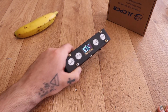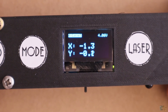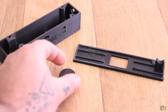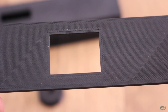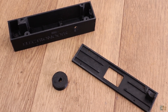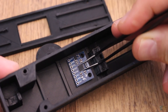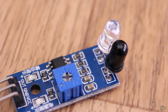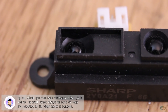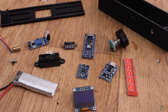Welcome back. We've already seen all the modes of this multifunctional meter — it could measure distance, angles and RPMs. First of all, it has a 3D printed case that I've designed, printed using PLA material with a 0.4 mm nozzle, 0.2 mm layer height and 2 perimeters. The case has spaces for all the modules: the MPU6050 gyro and accelerometer, the infrared sensor for counting rotations, the VL53L0X laser-based distance sensor, the Sharp distance sensor, the battery charging module, an encoder with the 3D printed wheel, and the Arduino.